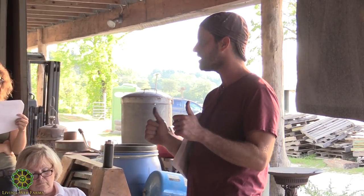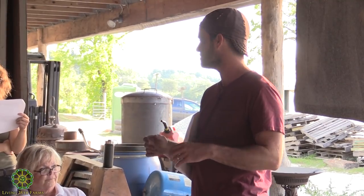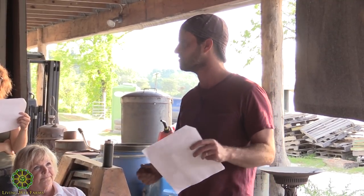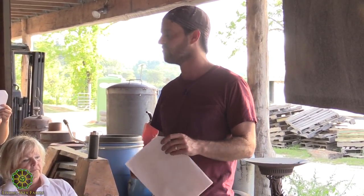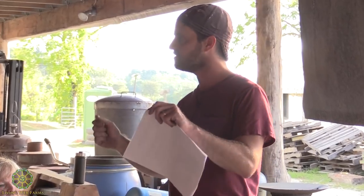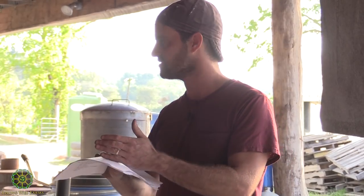As you go up in the high carbon steel, you get into stainless, it's a different animal. You can only work it so much before it becomes so brittle that it'll just break. But if you get in a pinch and you overwork a piece of steel, say you bend it too much, or you just need to start over, annealing is a good thing to do. Heat it up, gradually cool it. Tempering is that process of dialing in the desired hardness and the desired softness.